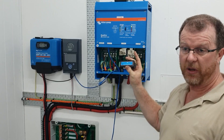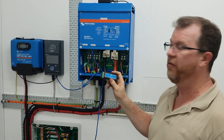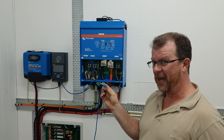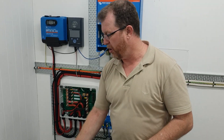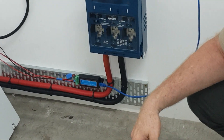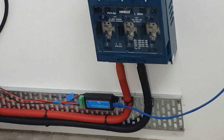When you've got this plugged in and the Color Control plugged in, you can have both at the same time, but the Color Control becomes the boss. So the dongle gets whatever information is taken by the Color Control and the Quattro — it doesn't get much say. But that's fine, because if you've got one of those you're going to want it doing the job. We've mounted one just down the bottom here because our battery bank is outside; I just want it here for display purposes and I'll run the cables through that hole — that hole is not my work, it was already here, I promise.